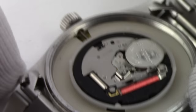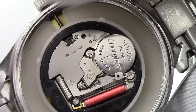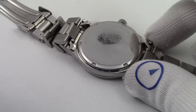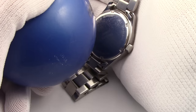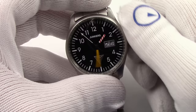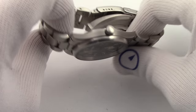Now we reverse the process. It's not very dirty; if it was, I'd scrub it, but you've got to be careful getting debris in the movement. It's not a diving watch, so I'm not too concerned about water resistance. The ball is best for screwing the case back — just a little bit of light pressure and you kind of just spin, and eventually it finds the raceway and the thread. I'm not going to use the case back tool to tighten it all the way — just push firmly and rotate, and that is surely more than enough. Put the deployant pin back in and we're done. Lives to fight another day. Great watch — big date, candy cane hands — this was my father-in-law's. After he passed, it was given back to me, which I thought was really cool.